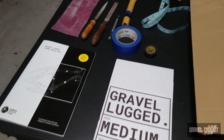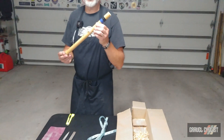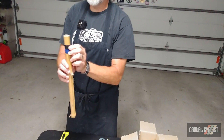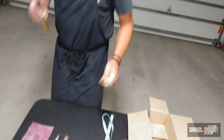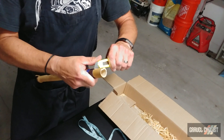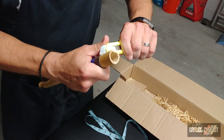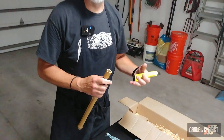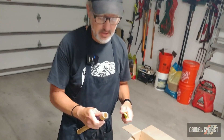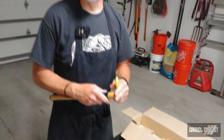Following the manual, you mark the tube with painter's tape, then build up that area with electrical tape. I've already got my blue painter's tape and electrical tape on here as a mock-up. Step one, once you've determined that distance, is to score all the way around — I recommend doing this a couple of times. You want these to fit snug into the lugs but not overly snug; you need a little space for epoxy to bond between the bamboo and the aluminum lug. You shouldn't have to push hard to insert the tubes.